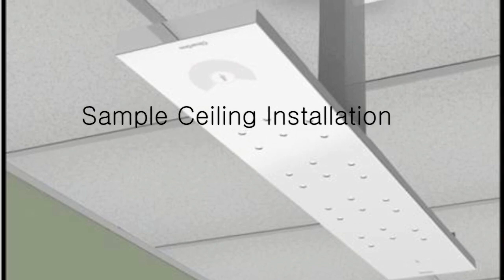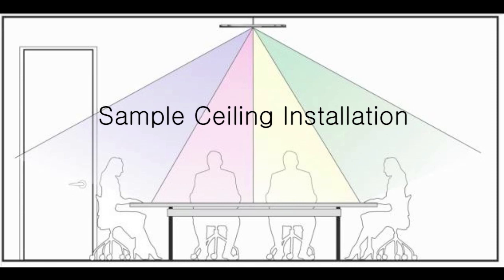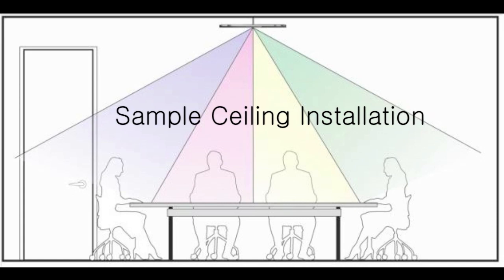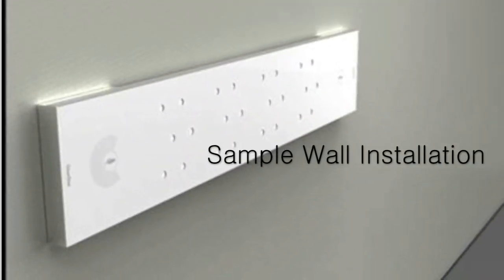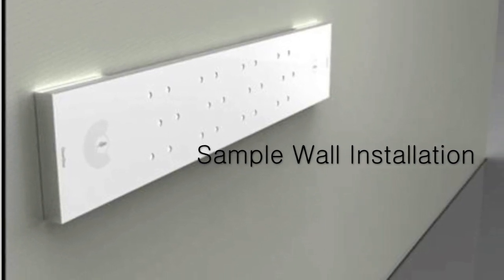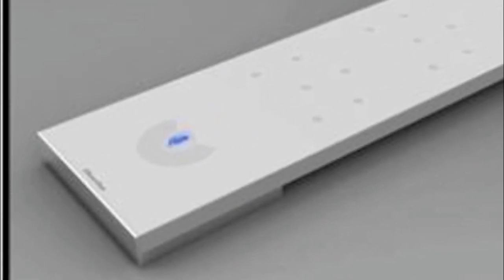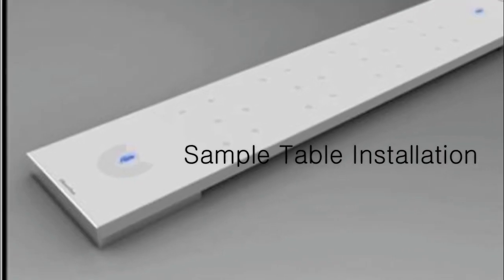The array has 24 mic elements in it. Every one of these mic elements has its own echo canceler, as well as noise cancellation. This is really how we got the Beamforming technology into the Converge Pro line — by adding an echo canceler to every one of the microphones participating in the array. This allows us to create a system that can go much farther than your standard microphone, and also reject much more of your room ambient noise and reflections.